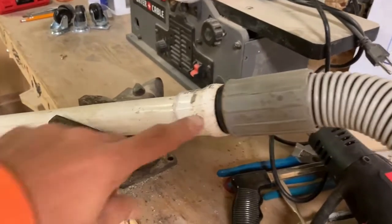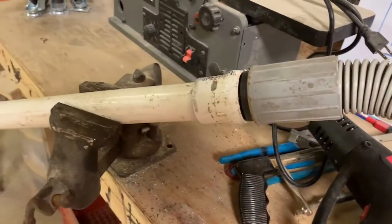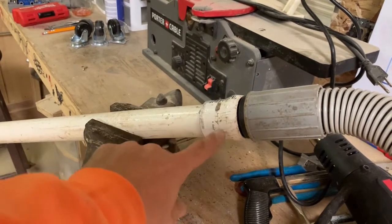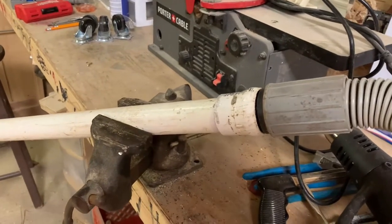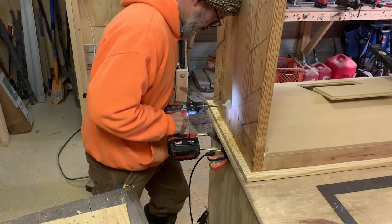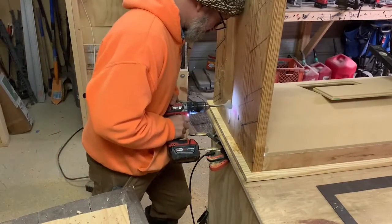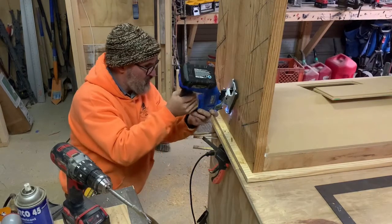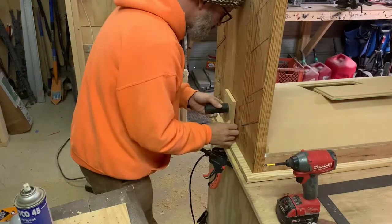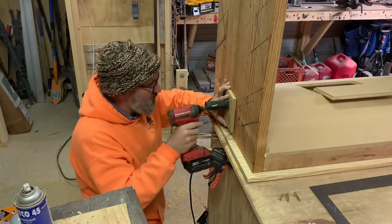Worked like a charm. Once that cools, that piece is never going to come out of there — it's got a good, nice, tight seal, which is fine by me. You guys can alter or adjust PVC just by heating it up a little bit — just be careful, it does get very hot. Using an inch-and-a-half spade bit and resting my giant noggin against it, I measured and then measured again, and then promptly drilled the hole in the wrong place. So I used the jigsaw to make the hole even bigger. I used a scrap piece of MDF to hold the tube and make sure that everyone knew this was a man's workbench.